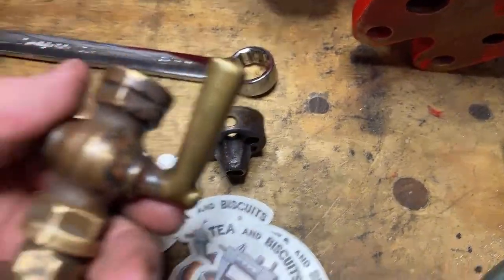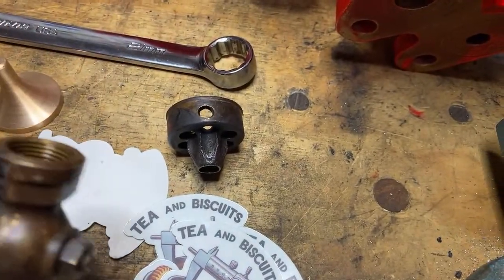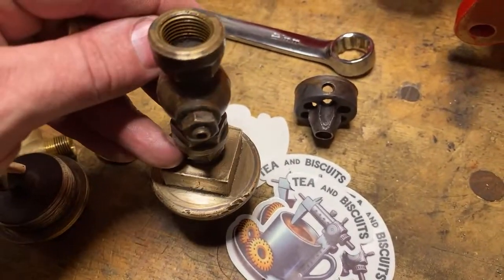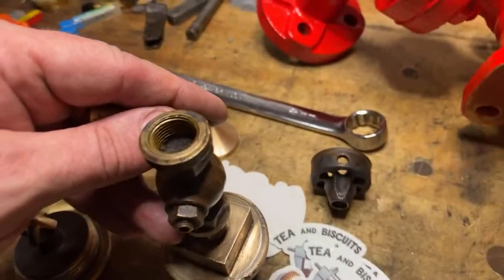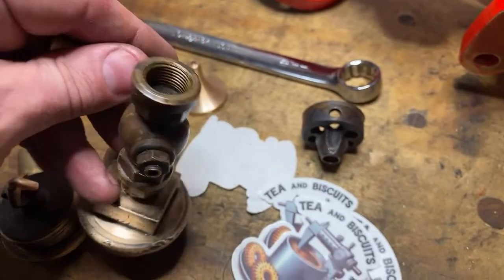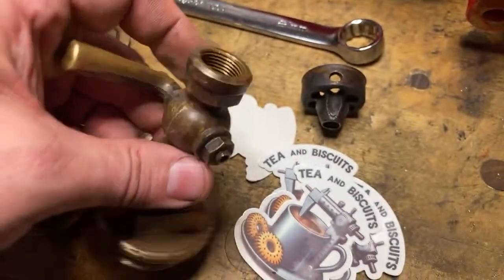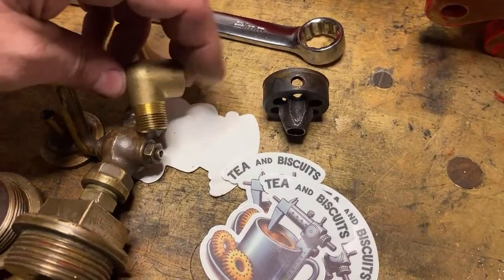It's quite a bit later, I think. Certainly not Fowler, but it's got a thread in the top, and if you just put it in like this, when you prime the pump, and there's no leaks in it, I'm guessing this is going to sort of squirt 4 foot in the air, which is a bit of a problem when it's directly under the steering wheel, because it gets you pretty well directly under the chin. So I'm going to put an elbow on top of that.